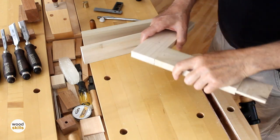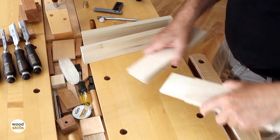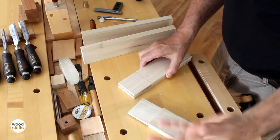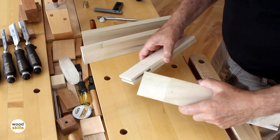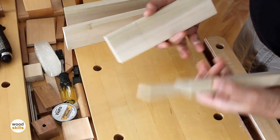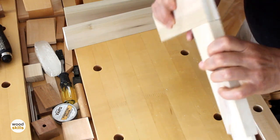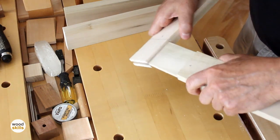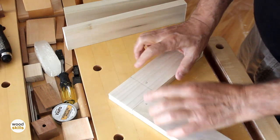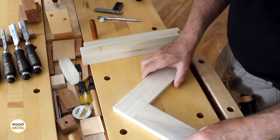So I'll be creating this bridle joint in this video segment, and it's a square bridle as opposed to a mitered bridle, which I'll most likely do in the next video. So this is a male tenon portion, and this is a female mortise. It's also known as an open mortise joint, so it fits. It's done entirely by hand with the saw, and I'll demonstrate the whole procedure. So I've had to label these because I'll be making quite a few of these. So I'll just put this aside.